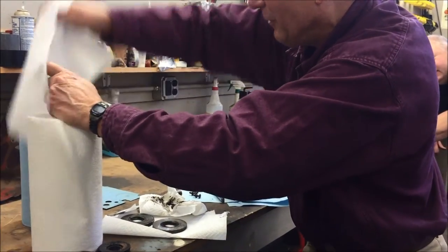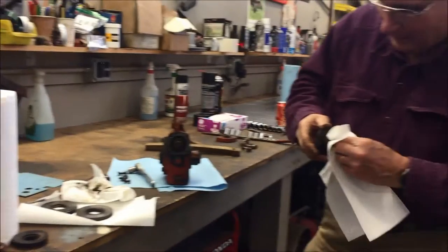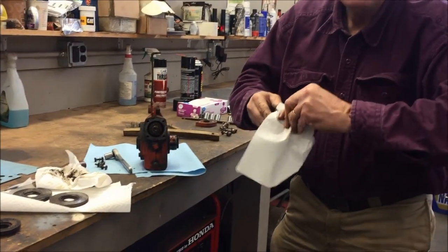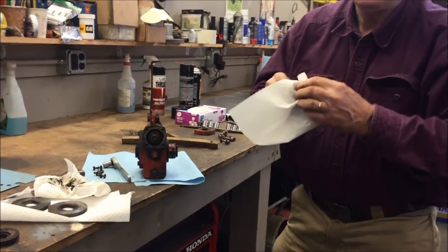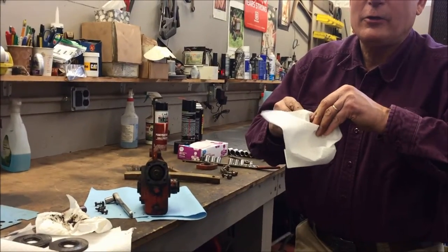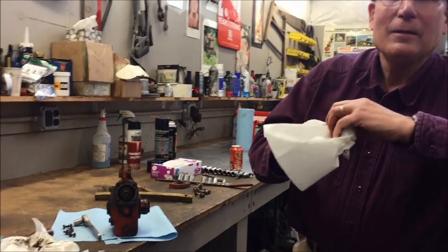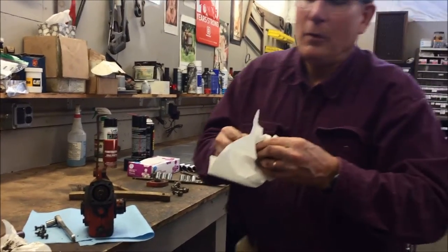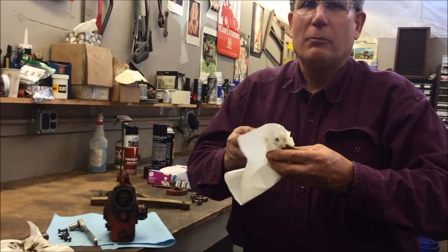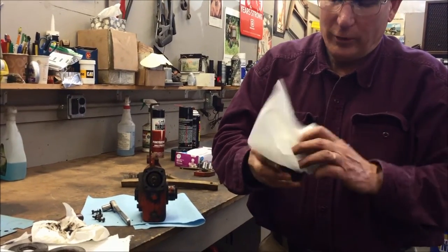Nasty oil — hasn't been changed in a while. At least it looks like it's oil and not grease. Now with the oil, I know there's special oil, right? What's that oil that you use in there? It's gear oil — it's like a 700 AG, whatever that is. Doesn't eat bronze or brass. Most of the new oils like that, anything made for a worm gear will not eat bronze. The old one was, I think, GL5 — that was the old gear oil.